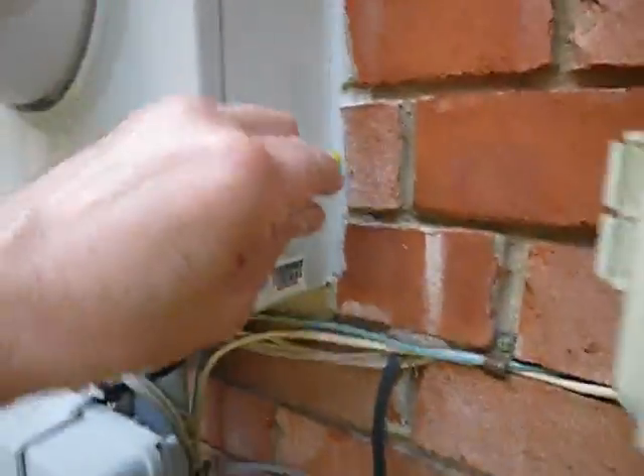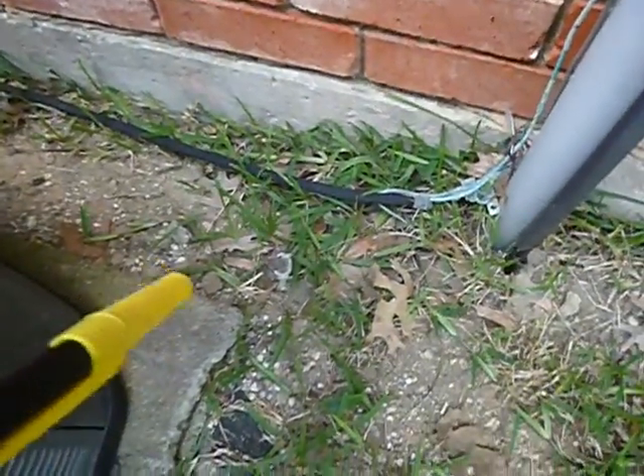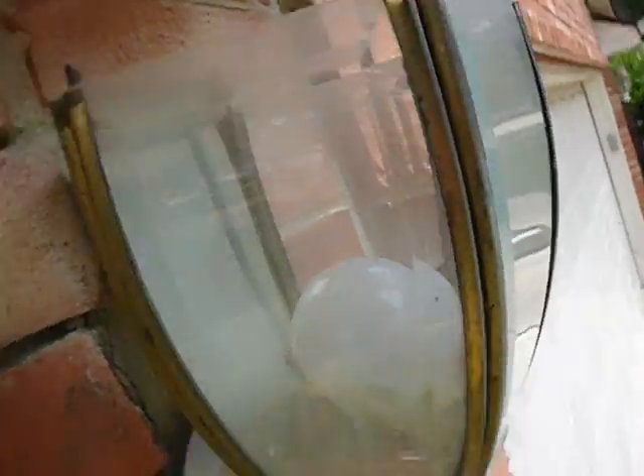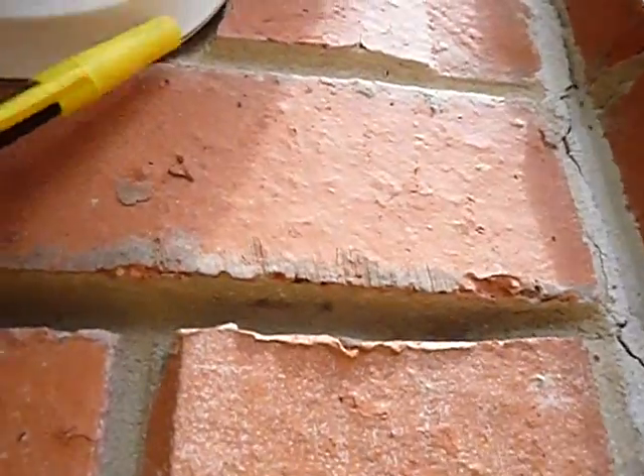We're on the west side of the house. There are some cracks on the west side of the garage. Electric power to the home is below grade and the box has been sealed. The grounding rod — those grounding rods are supposed to be completely buried, so you shouldn't have a grounding rod sticking up like that.